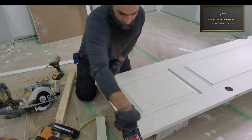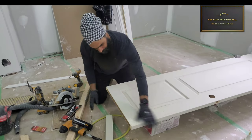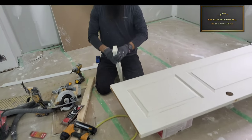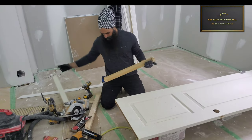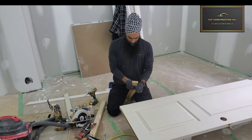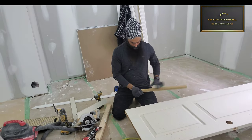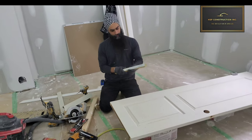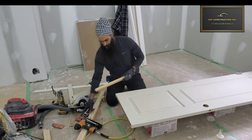As you know, this is a hollow door — an interior door. All interior doors are hollow inside; only a piece of wood goes around the perimeter. The piece I cut off has the foot piece in the bottom. I'm taking that off, and I'm going to put it back in so that the door will feel solid again from the bottom.